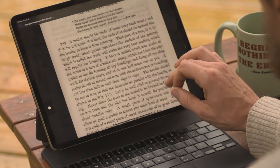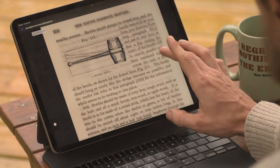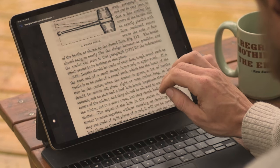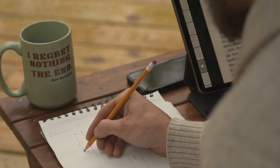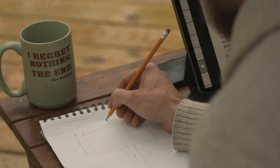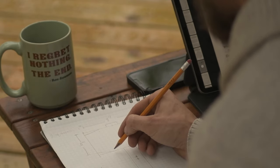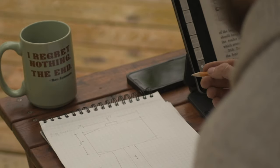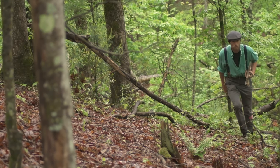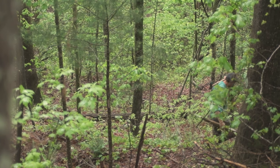Pages 257 through 261 detail an overview of making and using a hitting beetle — from the type of wood, the proper dimensions, and the proper handling of the tool. Beetles should be made of very firm, tough wood, such as the butt end of a small locust, ironwood, or applewood tree. The average dimension is 8 or 9 inches in length, with a 2-inch wide shoulder at the ends, being 5 inches in diameter. Rings made of the best iron, 1 inch wide and 3/8 of an inch thick. The handle should be no less than 1.5 inches in diameter and 30 inches in overall length. These measurements can vary depending on the wielder. As most people, I do not have the funds for iron rings, so here is how I will be making my beetles.